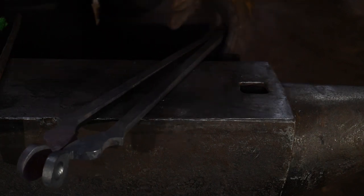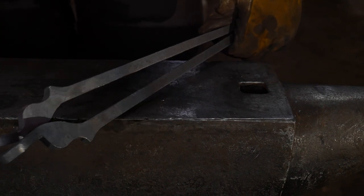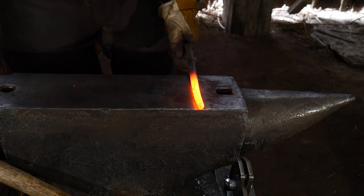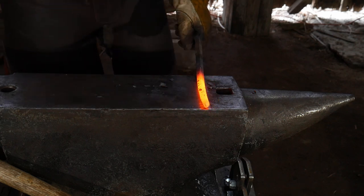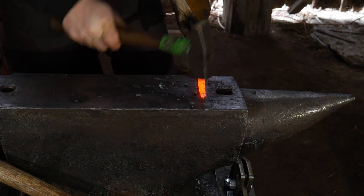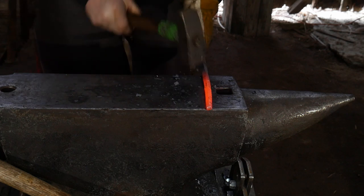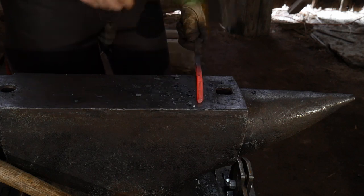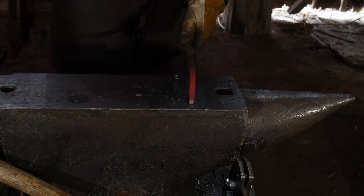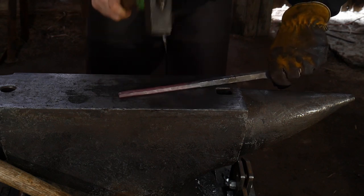Those are together now and hopefully look really good. They'll flip over and make up a really nice set of farrier tongs. We'll let these cool naturally and then flip them around to work on the reins themselves — rounded them up in the other video, and that's what we'll do here as well. I've got a heat about as long as my anvil is wide, which is about six and a half inches, and that's how I establish how long to hammer on each tong for regularity. All I'm doing is removing the corners — you can take as much time as you want to round this up.